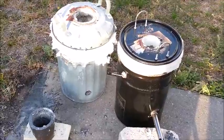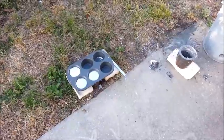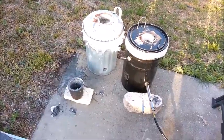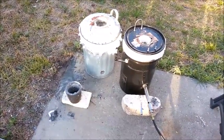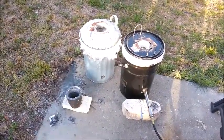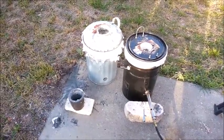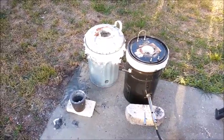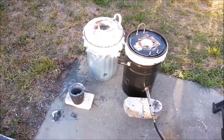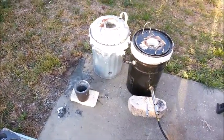Next project: redo the old one the same way so I'll have a foundry and a burnout furnace. Thanks for watching — this is working out great. I should have done this to start with rather than wasting time playing with homemade refractory mixes. Just go with what you know works — get some ceramic fiber, kaowool. I got it off Amazon; not terribly expensive for a roll of it. Time is more valuable than money. I wasted a lot of time on various homemade refractory mixes, so in rebuilding this thing I saved a lot of time — and as far as I'm concerned, a lot of money. Thanks for watching — more from the backyard foundry in the future.